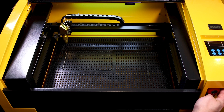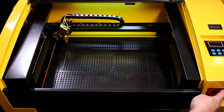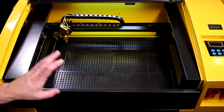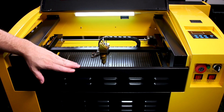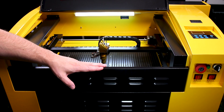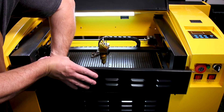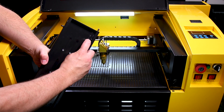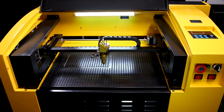This laser has a nice little work light built into the back of it, turned on and off with a little switch on the panel. Let's go ahead and look at how you remove these panels on the front. All the panels on this machine that are painted black come off for servicing or to reveal features. These panels come off with little latch systems on each side — they're just spring-loaded clips that move in and out. You might want to give these an oil as it makes them easier to operate.